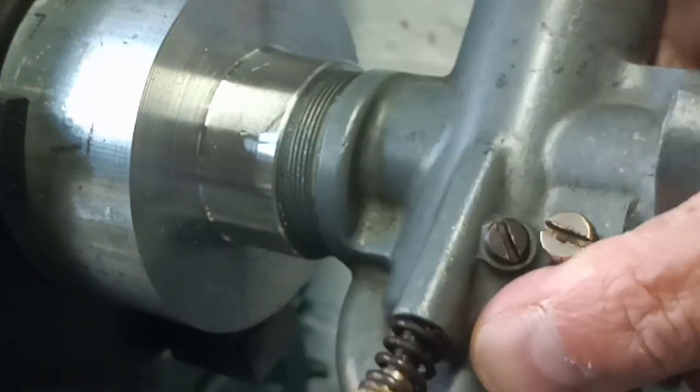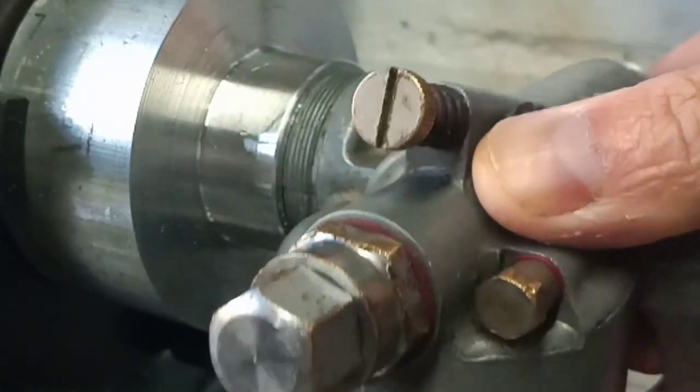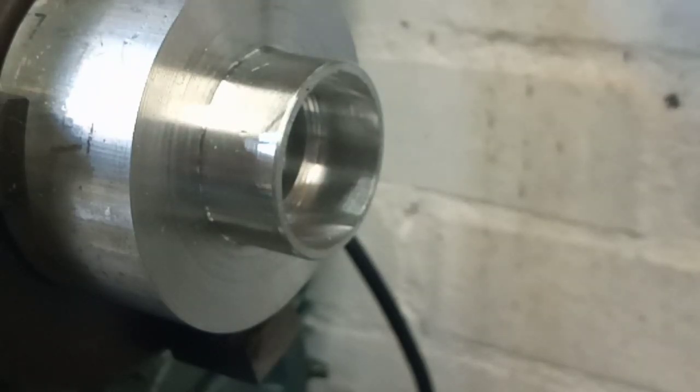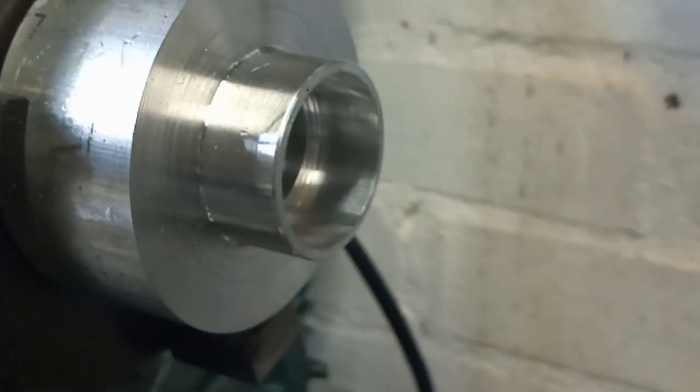I think if a thread were cut in there, that would screw on perfectly well. It just needed a soupçon more — great word. I need to do a little bit of cleaning, get some bluing in there so we can see the thread we're cutting, and then set the lathe up to cut a 24 TPI thread — something I've never done before. This will involve the deeply sinister universal quadrant there on the pegboard.